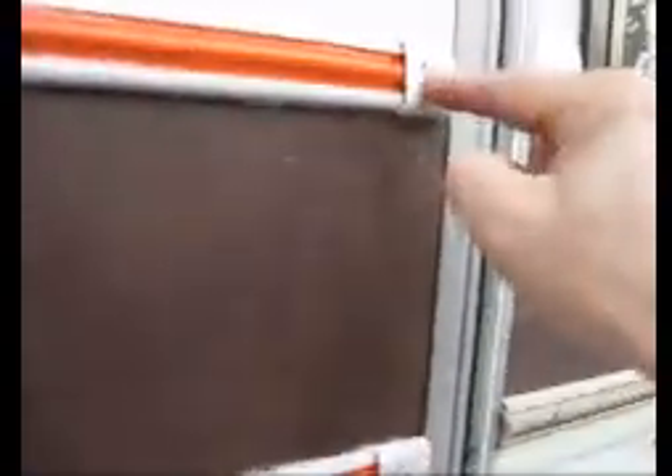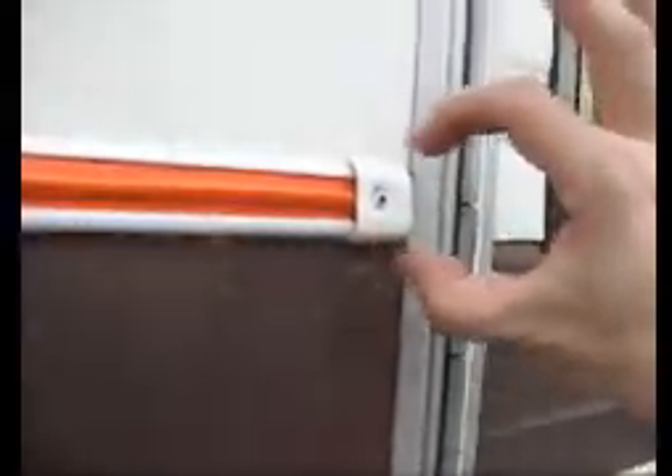After being interrupted about three times trying to film this video, I wrapped this up and got these pieces back on here. Not the prettiest job — I've got to clean up a little bit with the caulk. As you can see up here, I've got them screwed back in. The difficulty with the new strip is it's hard to tap that screw through the vinyl. I usually hold the back a little bit and use the screw gun to tap it first and then suck it in. You can see the screw bulges here — there's one here, another bulge there, and another bulge here.